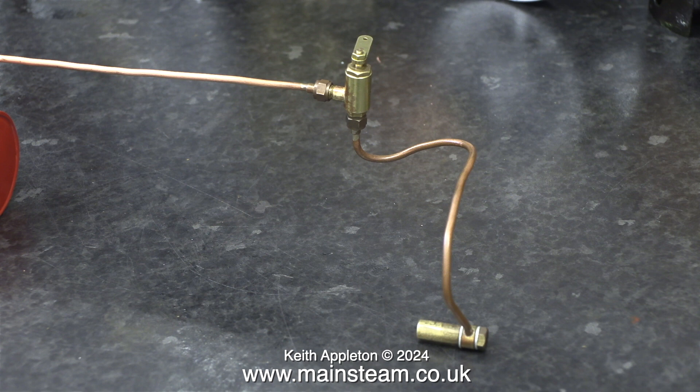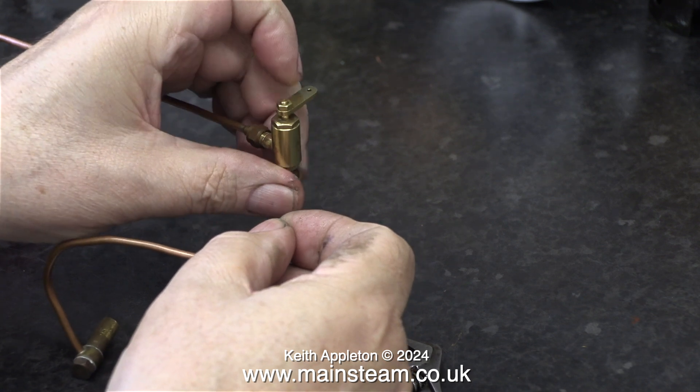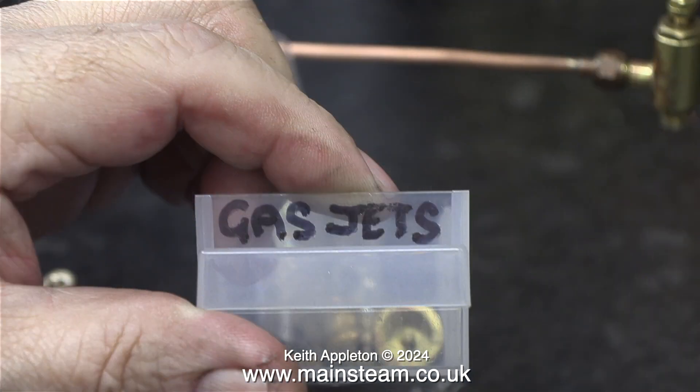This clip shows the Clevedon Steam emergency gas cut-off valve, an essential part of any miniature steamboat. The worst case scenario is if the boiler runs out of water: not only will it be damaged, the outer cladding will turn black, and even worse the ABS plastic hull could melt. There is a relationship on these miniature steam plants between the size of the gas tank and the size of the boiler. Using these Cheddar Models steam plants, you get about 20 to 25 minutes of steam time, which comes down to one or two factors, and the obvious factor is the size of the gas jet.